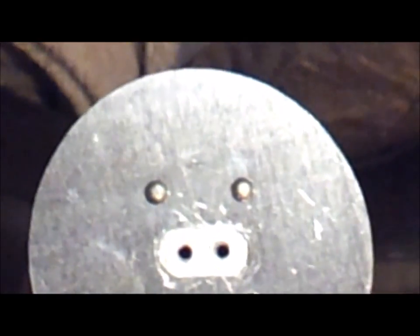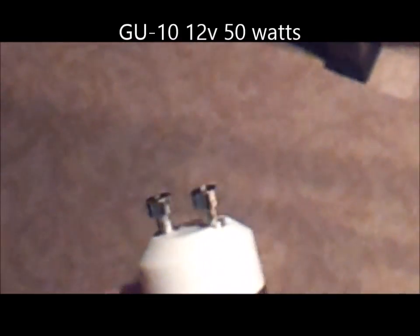The solution, in my opinion, is to replace these. You can see I've cut this one off and I'm using a different style. They're ceramic bodies — it's called a GU10 ceramic body. They've got a silicone wire, high-heat wire, using high-heat wire nuts. They're porcelain wire nuts. And then the new bulb — they're still 12 volts. But you can see there's not two little pins; you've got two good-sized knobs that turn and lock into the body of those housings.